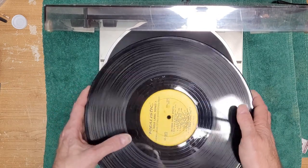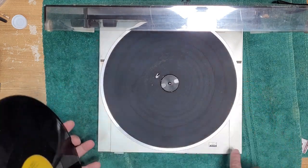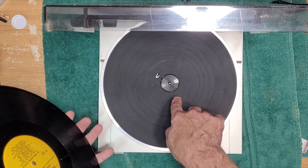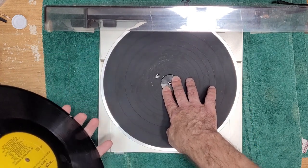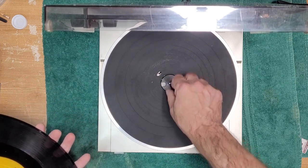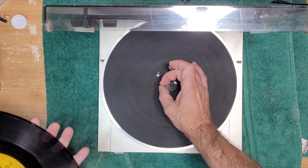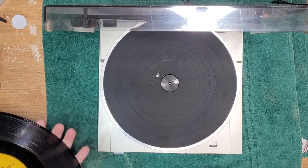But if you have a 45 RPM record in the 30 centimeter size, you'd have to put it manually onto 45. So once you push down on the record, it pushes the record platter down here, it pushes this down, it tells it that a record is loaded, and so does this. Okay, actually, this is not the trigger for it. This just sits down, because if you have a 45 with a hole, it just goes down. This tells the record player that there's a record on here.